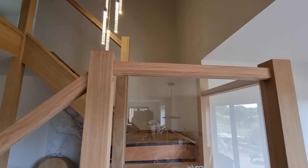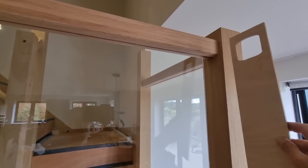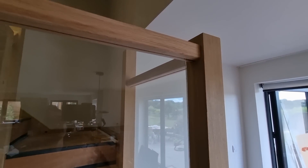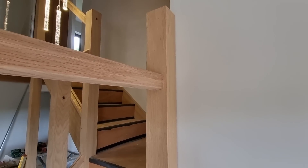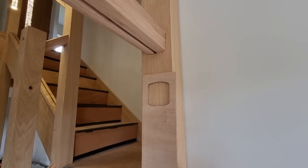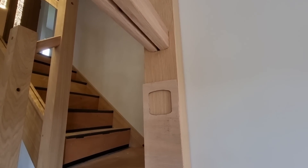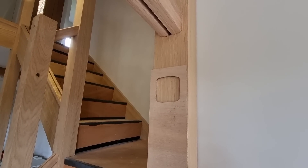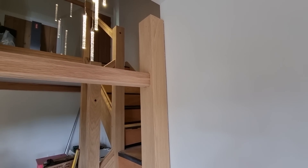With the straight ones it's a bit more complex. You can butt and fix those as well, but what we actually did was form a very simple template of the handrail — basically how the handrail fits on. We clamped that to the newel and started using a Forstner bit to remove some of the stock, because we wanted to then trim it with the router on the face of the newel. We didn't want to remove all that stock with the router as it generates a lot of dust, so we hold a vacuum cleaner underneath and bore it in.